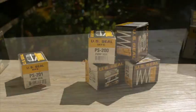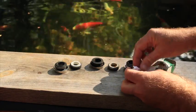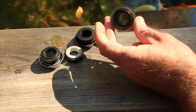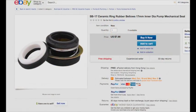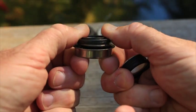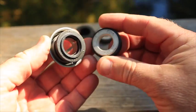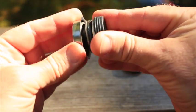There are a variety of seal manufacturers, designs and sizes. So unless you can order a new seal based on your pump model, you'll need to measure the inner diameter of the seal and the outer diameter in millimeters, and then also match the design up to what you are replacing. The basic premise of this ceramic seal is one side is spring loaded, and the two hard slick sealing surfaces slide together as the pump spins, forming a watertight connection.